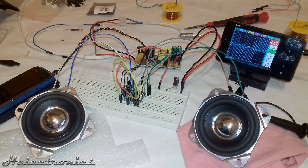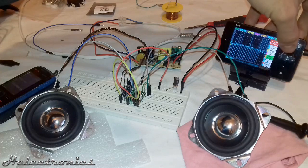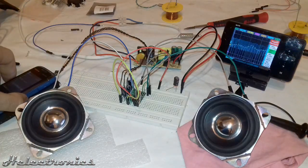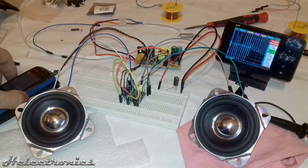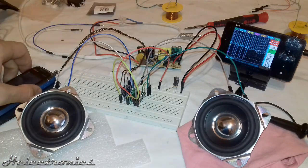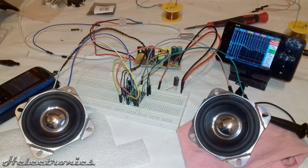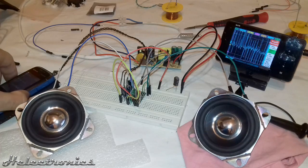Without the coil the sound quality was a little bit better. When I turned the volume to high, the module started to skip a few milliseconds and go to full excursion when low-frequency sounds came. This was probably caused by the phone — I was using an old Nokia which had a higher output signal than the Samsung, and the module just shut down for a short time.